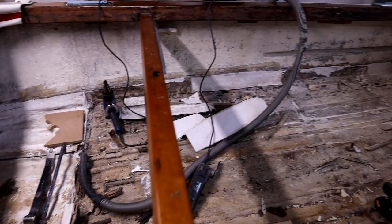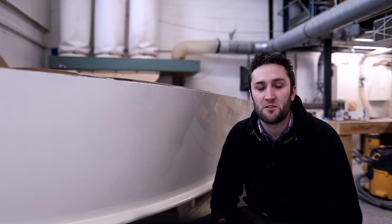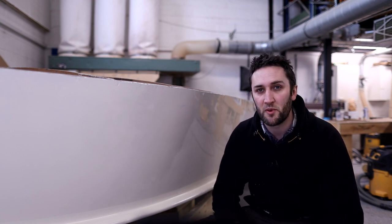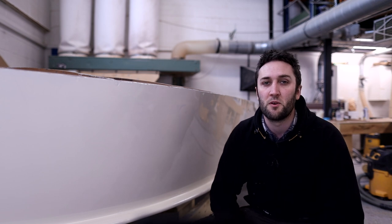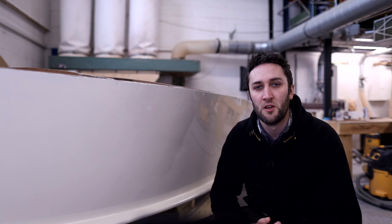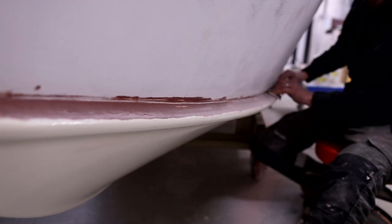I painted the whole inside of this boat with two coats and that gives a really nice backup protection to the epoxy coating that's already on there. Looking at what this boat was like before, it looks a little bit smarter inside now. One thing to note: this paint doesn't have great UV resistance, so it's really only usable for bilges, behind side panels, and flooring — areas not in direct contact with sunlight.